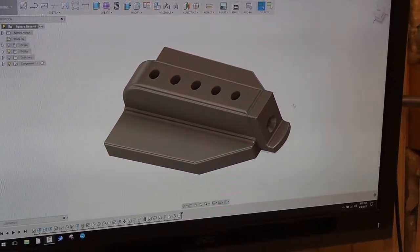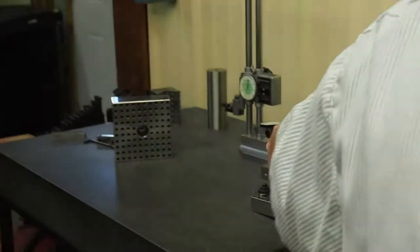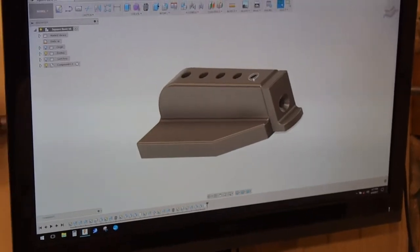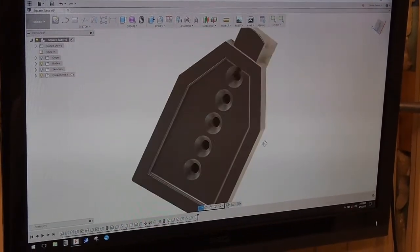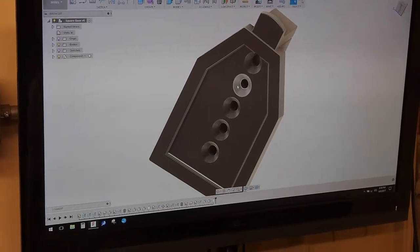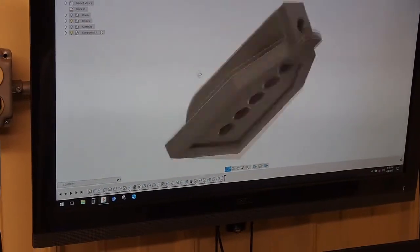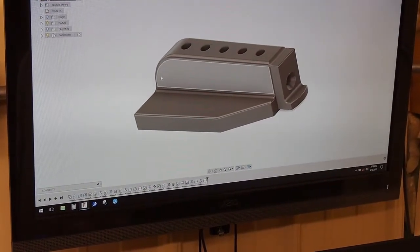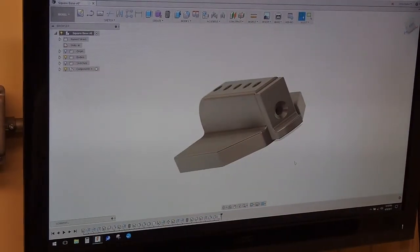But the Noga flex arm that I have over there, this part, with this stem, it'll fit in these holes. So I got a lot more adjustability, different places I can go, and we got the bottom of this. We'll have it hollowed out just like we have on the Mitutoyo base. I also will countersink these so that I can have a 5/16 screw that will fit in there, so that if I want to bolt some other attachments to the top of this from the bottom, I can do that because I got some other ideas that I'm going to use with this as well. But the main thing I'll use it for is a squareness checker.